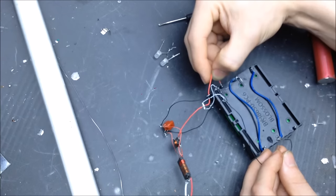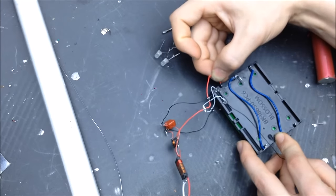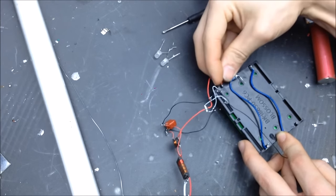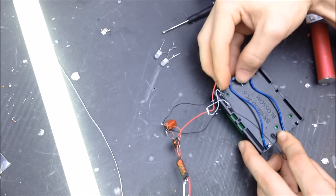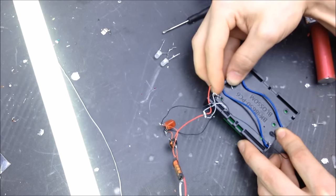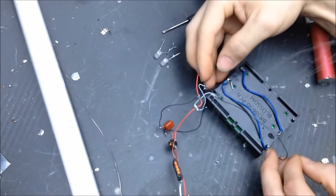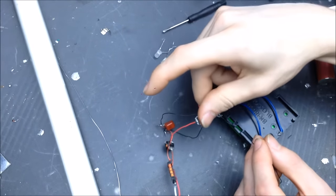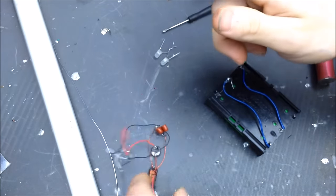Well. Oh, hey. You saw that. I didn't see any smoke, so I'm betting it's still good. Wow. Look at those little tiny MOSFETs juicing. Oh, there goes the smoke. Let's see how long it runs. Let's see what's failing. Ooh, that's the transformer primary. Wow! That is impressive. Those MOSFETs aren't even warm. Well, they're warm, but wow.